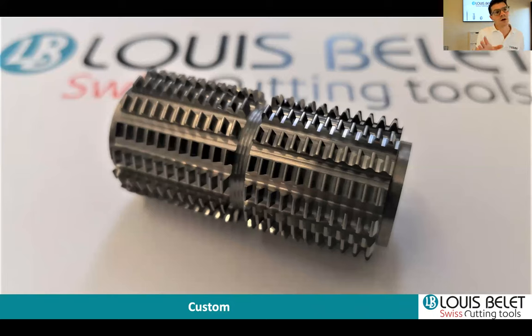Should you want to have a smaller region for the deburring parts or for the zone 2, on a ring it's easy because you can just switch it and you have the complete part for doing the deburring and the gear cutting. But of course, if you are using a double or a duplex hob cutter on a shank, we might make the second region smaller for the deburring.